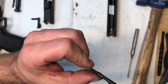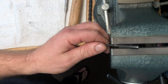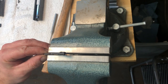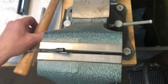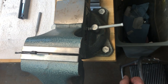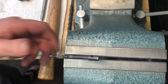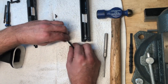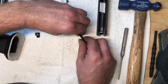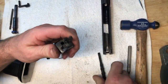So on these spring steel versions — and it's not just the Aftec, any good spring steel extractor — you can't bend these with your hands. These are stout. So we've got to back up here and look at the vise. The pivot point is right about here on these, so I'm going to pinch it in that spot in the vise in front of that first hole. Now this is going to seem barbaric, but you're going to use your persuader — I've got a 12 ounce hammer here and we are going to hit that whichever way we need to go. The trick to this is really just tapping it and watching — you'll see it move. That one moved a little bit. And once it moves, you reset.